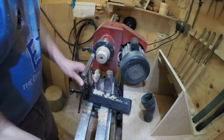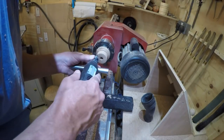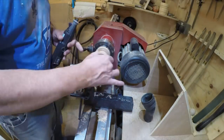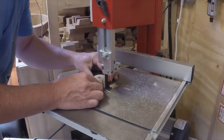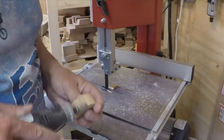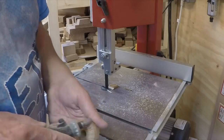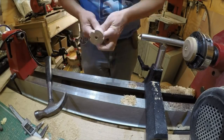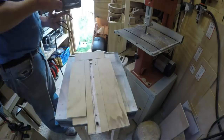I decided to use the rotary tool to see if I could add some grip texture, but with this being oak it just wasn't having much impact and was going to take absolutely ages, so in the end I decided to just part it off and cut out some grooves — I only did four notches on the saw, then went back to the rotary tool with the sanding bit and smoothed everything up. This worked really well; it's nice and easy to grip. Inserting the nut was just a case of putting the nut on the coach bolt, placing it on a hard surface, and gently hammering it in.